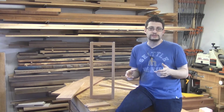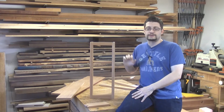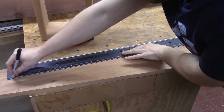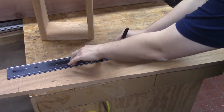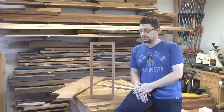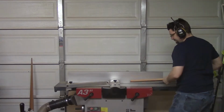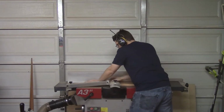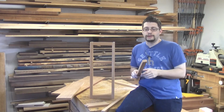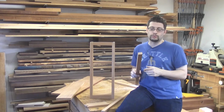Let's cut another piece. So I went over and I found a piece of mahogany that had very similar color as the cabinet. And as you'll see in the video, I drew a nice line to make a new point on the board to rip at the bandsaw. The reason I did this is I want very nice and straight grain on the door rails and the stiles. Then I milled everything up after pulling the new board, so to speak, out of the old board, and because I wanted that straight grain, the grain direction was not parallel to the edge of the board.